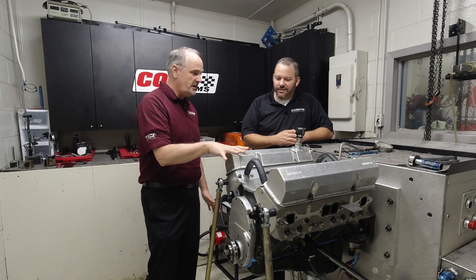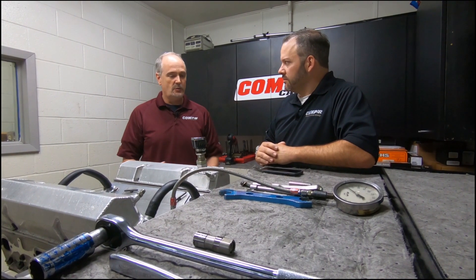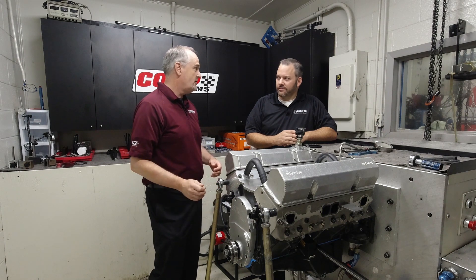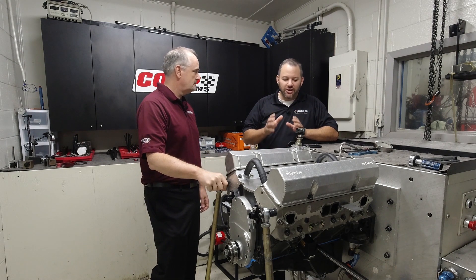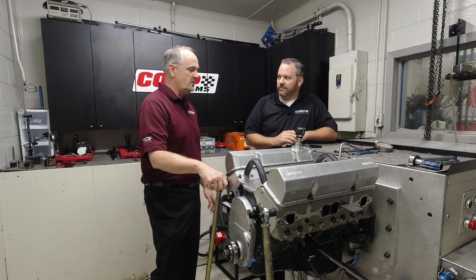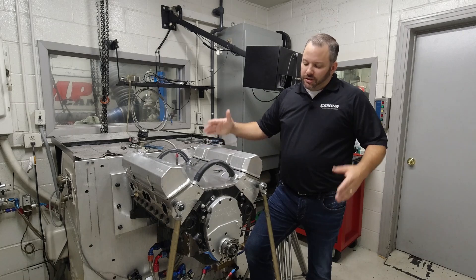That's great information. This is an amazing tool — I look back at the guys who had to do camshaft development without seeing what the valve was actually doing. I came into the first generation of cam designers that could actually work from seeing what's going on. Basically, it's cheating — we're looking at the answer sheet before we take the exam. This tool, when you know how to use it, shows you the answers before you go over to the dyno, and then the dyno doesn't become an investigative tool — it becomes a confirmation tool. You can have a spintron and all this data, but if you don't know what you're looking at or what to do with it, it can be a very useless or even dangerous tool. There's a lot to be learned about what to look for on the spintron.